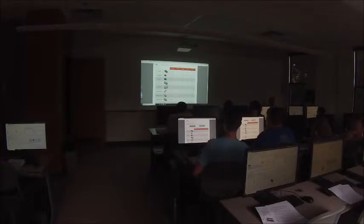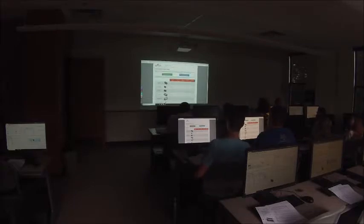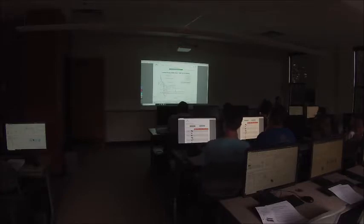As you can see from that locked rotor stall test, which is the thing I just showed you, it takes 35 seconds to burn this motor out completely, which is a long time. That is a long time for a motor to be stalled without failing completely.